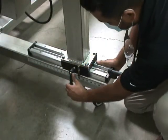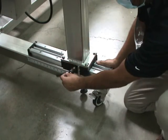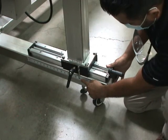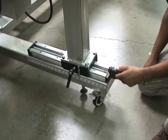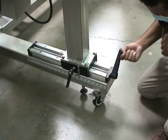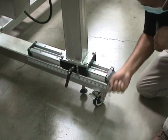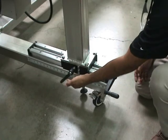Here's how to adjust the in and out on the applicator mounts. There's a lock there — he's unlocking the handle. You can actually write down or indicate where you want the applicator to be: it's got a tape and a pointer. Here's a handle that lets you adjust the applicator head in and out for different product sizes. Counter-clockwise moves the head in and clockwise moves it back out. Move it back out to your position, then lock it up tight so it won't move.